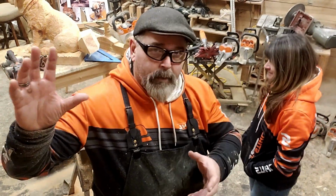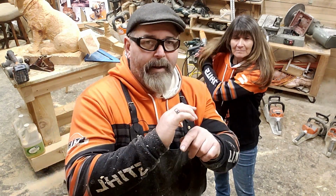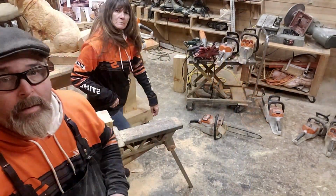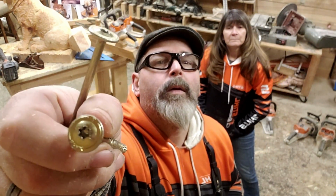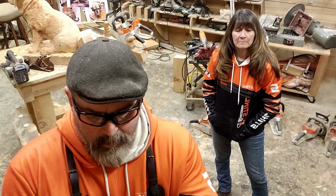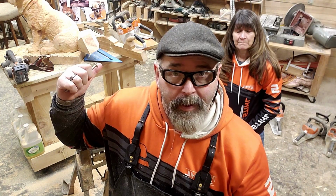And unfortunately, it happens. I mean, when you're laminating weird angles, it's tough. A lot of times what I'll do is use a long lag, drill a hole or whatever, or just put a long screw, like the Spax. So these are what I normally use. These are T30s, I believe. So they've got the bigger heads, and you get these in all different lengths and thicknesses. If you get one about that long or this long, you can plow through it and really get it to seam up, and don't worry about the holes these make, because they're easy to fix. However, big open cracks are not.